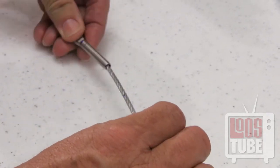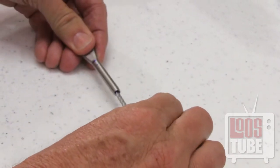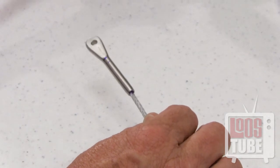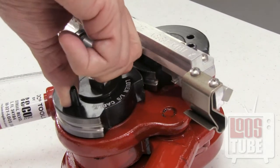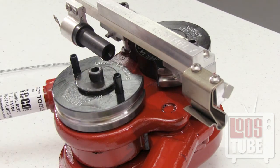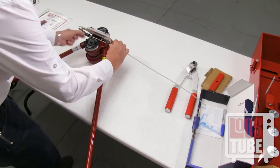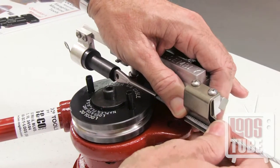Press the cable partly back into the bore and bend sharply, then insert the remainder of the way. This will ensure that the fitting will remain in place on the cable while being inserted into the machine. Now ensure that the upper and lower dies are centered. There should be a clear opening to lay your fitting and cable into. Insert the end of the fitting into the feed guide adapter and snap the cable into place.